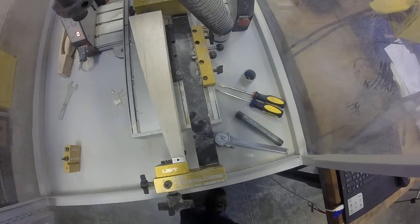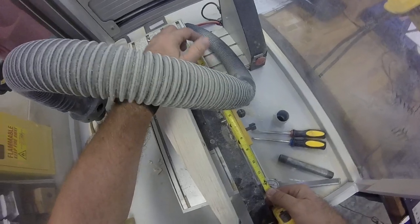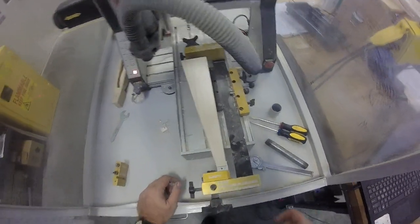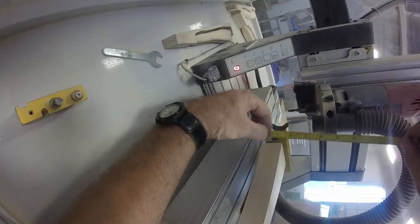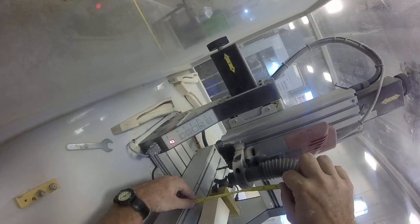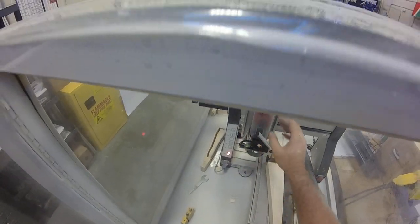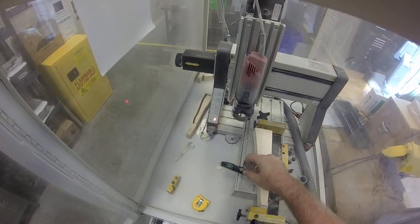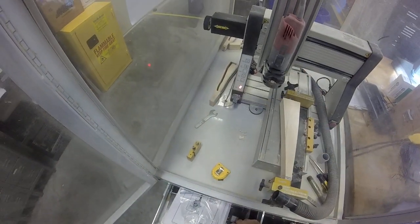All right. We've got this sticking out 4 1/4, or if I measure from this direction, it's about 12 inches from here to here. As far as position, that's a nice cubic area, and we've also moved this up about 6 inches, and then we checked it for level this way, because when you move this it might tilt and you don't want it to be tilted, so you've got to be level to the table. I try to match wherever the table is so the tools are square.